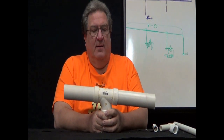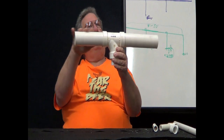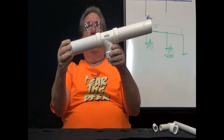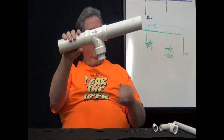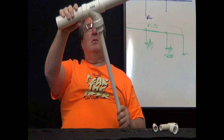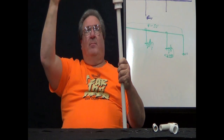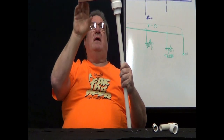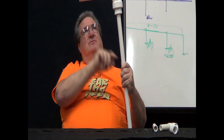So we're at mistake number two. In mistake number one we ran pipe level; now we're running it off level. At mistake number two, guys take and go straight down for their drop to go to their tools. This is probably 10 feet in the air, maybe higher. But they go straight down, and whatever water has condensated in this tube will go right down and head through your tools.